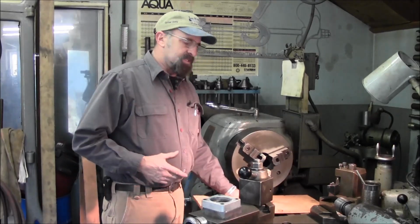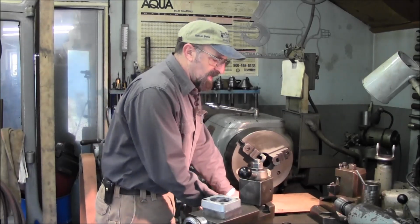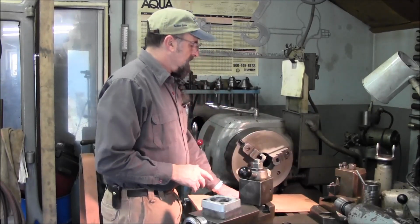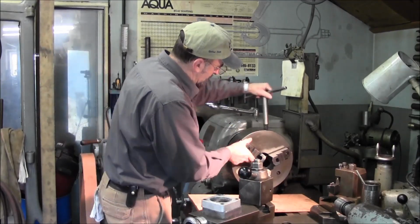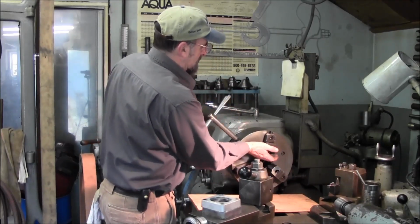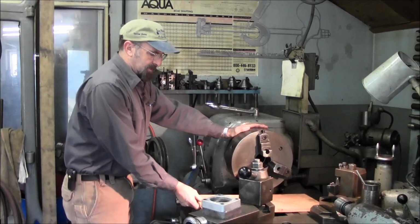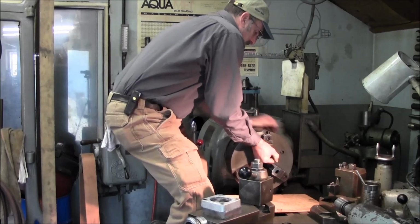This plywood is a good thing as well, except for the double V on this side and the flat on that side. The board actually angles and the chuck wants to roll off the other side. But there's another thing that we can do here as well. Before I pull this off, I like to have this jaw open a little bit so I can get my hand underneath there anyway. And also, I know that when the number 2 jaw is up, the chuck is in line.